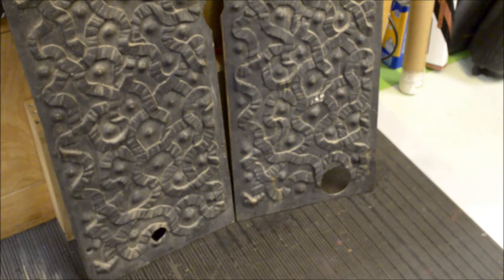The one on the right is three and three-eighths of an inch in diameter. That took me over four hours to drill with a hole saw. Ultimately at the end, the Dremel with the cut-off wheel was the best process to get that done.